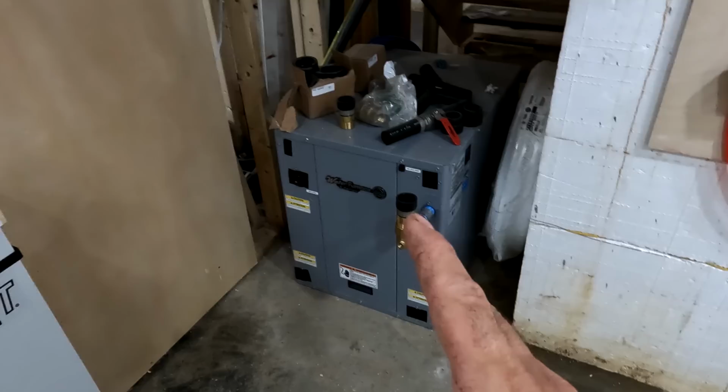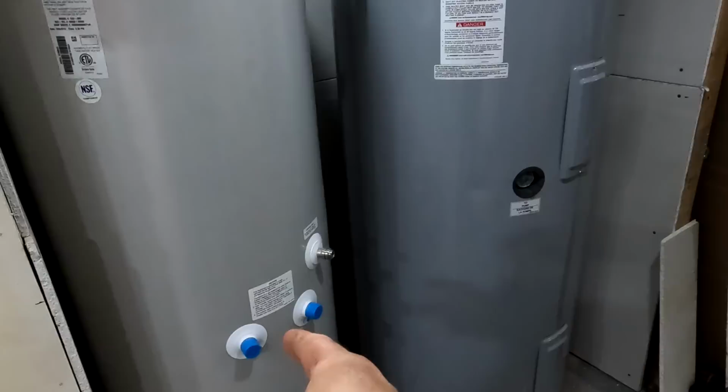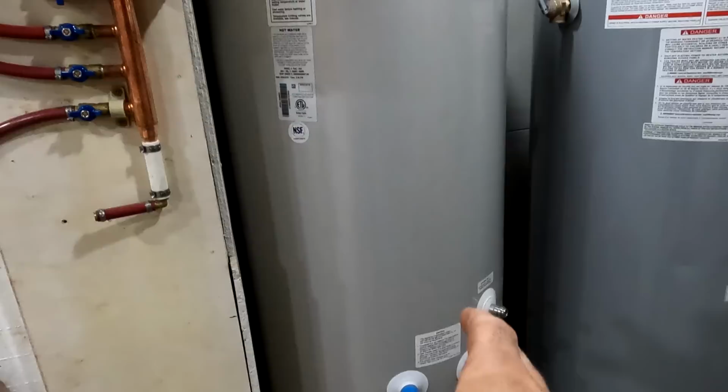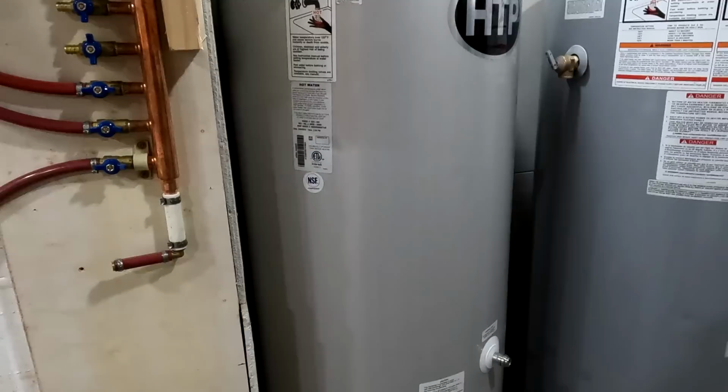So somehow I'm going to figure out how to use that de-superheater in conjunction with this domestic hot water tank, which is basically using the geothermal system to heat that up. And this is actually very rare for you to find a system that also heats the domestic hot water in the house, but it's super efficient to do this. Now, this tank was expensive. I think this was about $2,200 for this tank. That is really expensive. It's going to take me a long time to recoup this.